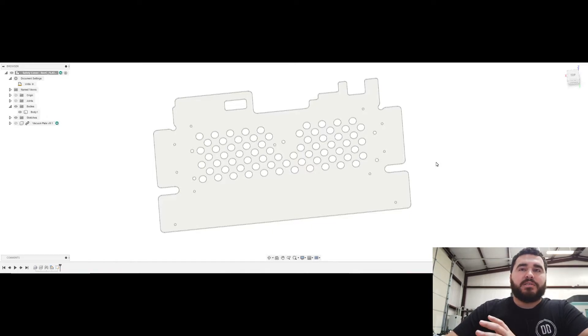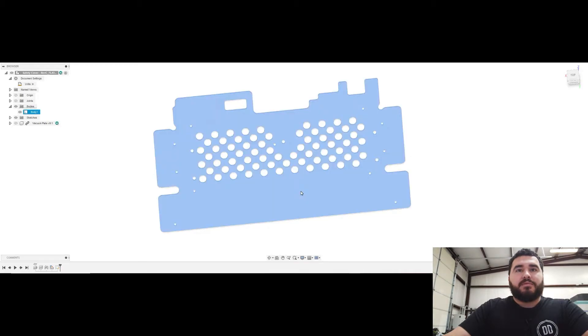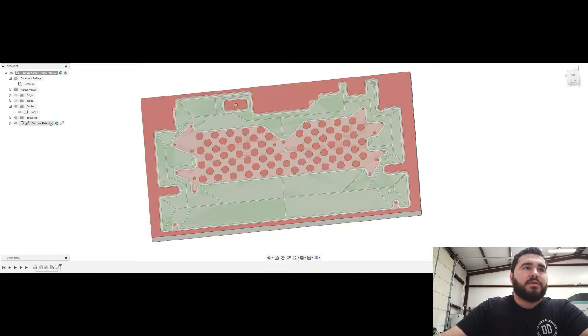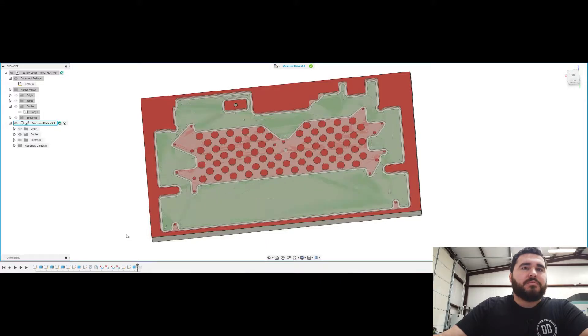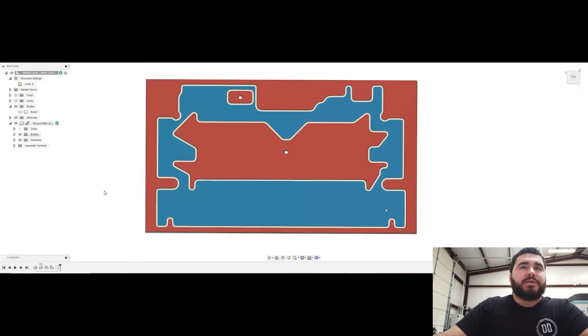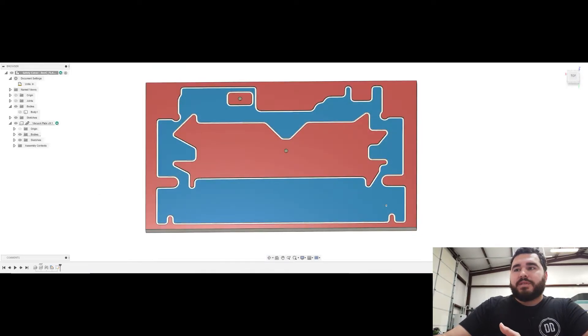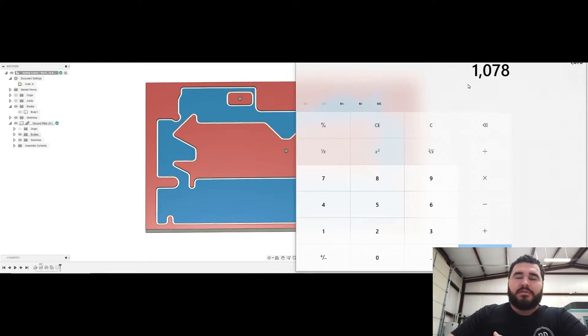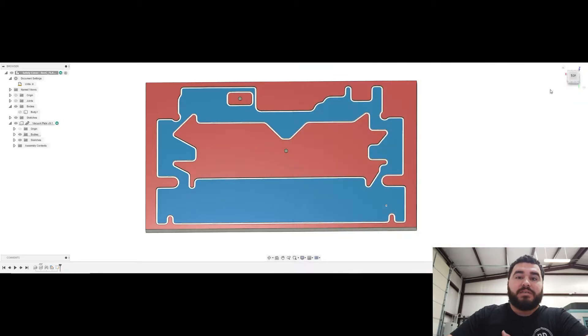The general tip with making a vacuum plate is to vacuum on as much surface area as you possibly can. If I could vacuum on the entire blue surface area, which is 125 square inches, then 125 times 14 PSI gives us 1,700 pounds of holding force. Instead, we can only vacuum on the green area, which is only 77 square inches. So 77 times 14 gives us 1,078 pounds — that's about a 35 percent decrease in holding force due to areas we have to exclude.